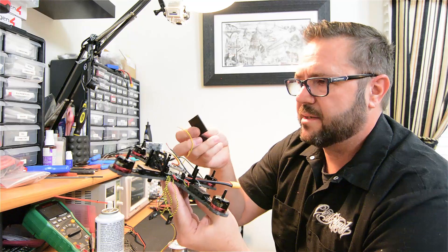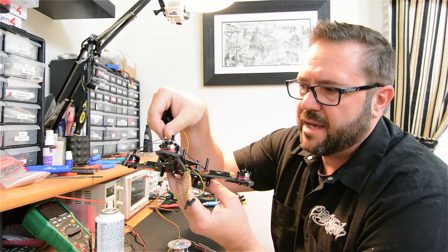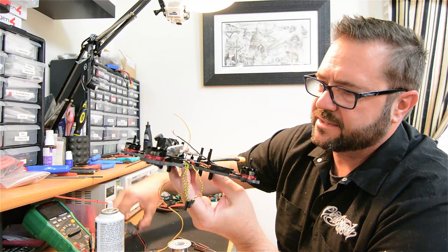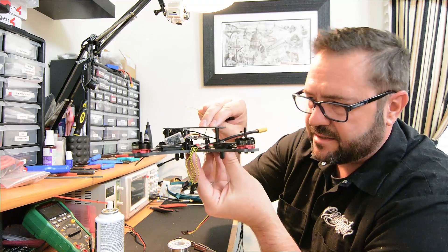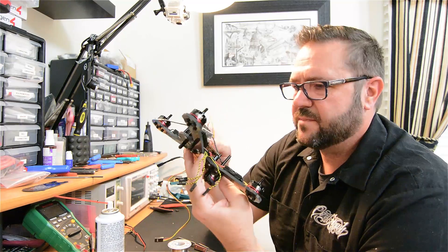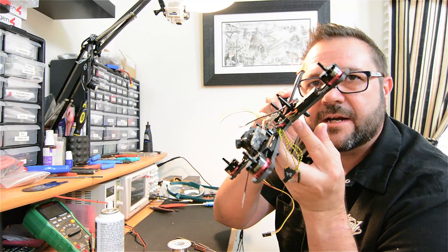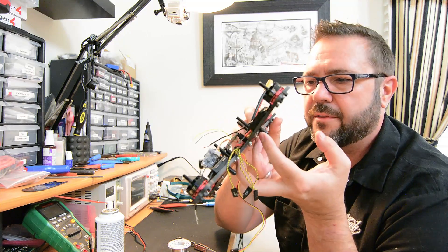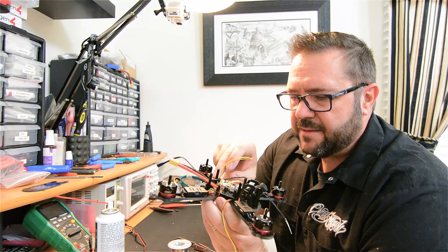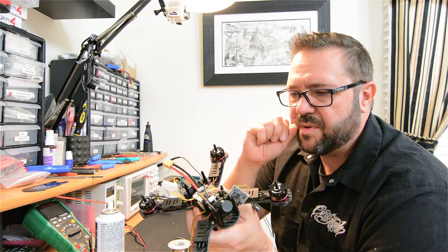I've 3D printed a few parts. This is a little block I'm going to put on top of my flight controller, and I'll be able to mount the receiver and on-screen display on top of that. That should still fit underneath the top plate which goes on top here — it's like an ice cream sandwich, you run out of space quickly. I've got the camera installed too — you can see it's pointed up, because when they're flying they're generally going at about 45 degrees at full throttle. So lots of tedious work. Next steps are putting caps on the ESCs to protect them from power spikes, then getting the VTX wired up, and then we'll be ready to start configuring.